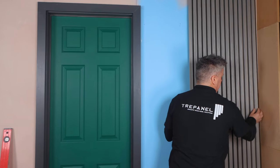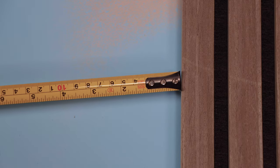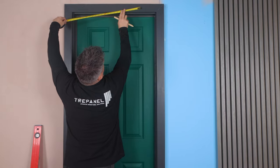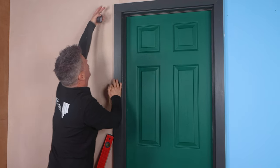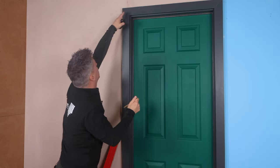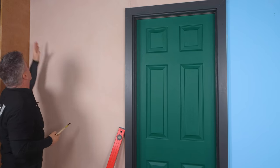My first panel starts here at 600 millimeters. I've established I've got a good size piece here, and my cut will continue to about this point. The next one beyond that goes from there and finishes around here — great. So when the full piece goes on there I'll be cutting a small slither where it steps over the top of the frame, which wouldn't look good. That brings me another full one from about there to there, leaving a healthy cut of just under 500 millimeters — giving me four full boards across the wall.